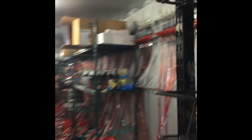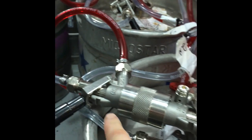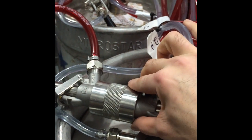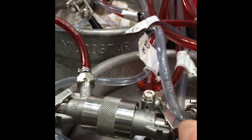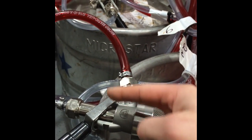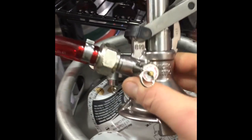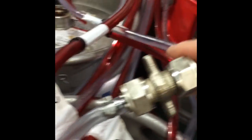Inside the cooler, you'll see that every beer line is uncoupled and put together so that the beer can flow like you saw before. This is a dual flush coupler which holds S and D style couplers. It pushes the check ball up so it keeps the flow moving. If you don't have that style of coupler, then you have another one kind of like that.